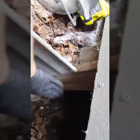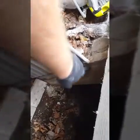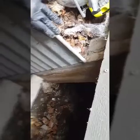In this scenario, the main framing board is attached to the well, so I can't replace this wood without ripping out the entire well, which is a lot more of a project than is needed. So what we're going to be doing is I custom trimmed some brick to kind of make a foundation. I'll be working to get this level, and then when I put in my first piece of pressure treated wood as the bottom of the frame, I'm going to make sure that it is a snug fit between these two boards. That way it will help keep the frame in place, and it will also help keep this makeshift foundation line in place. In the end, I'm going to have to dig and install some screening below the brick, just to keep anything from burrowing under, but that's another project for another day.